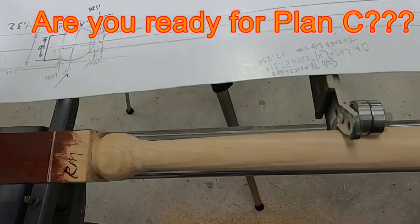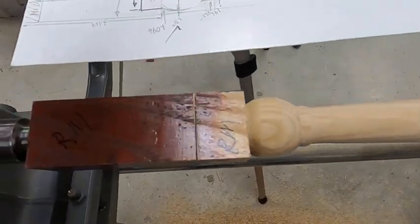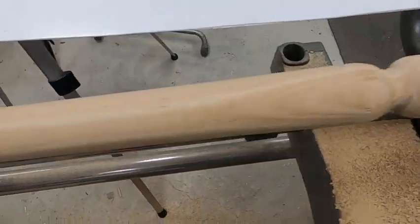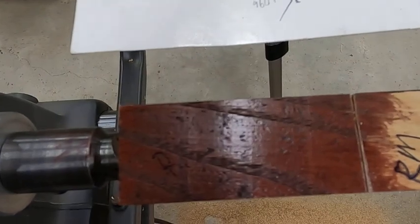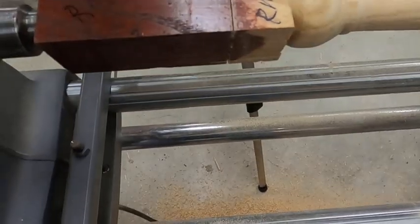And as you can see, the finish on them is a very, very dark cherry. It appears to be red in that light. Well, I went in for a trial fitting yesterday. I took this rough turned spindle in, and I found out that this color here is too red, and this one here needs to be just a little bit darker. So it just needs maybe two coats, or I may be able to get it with one by just letting it set and nearly dry before I clean it off of there.